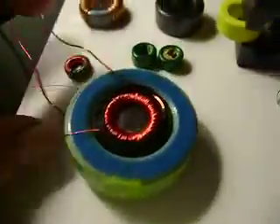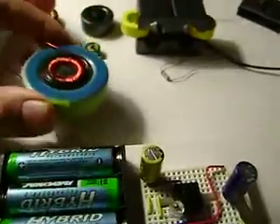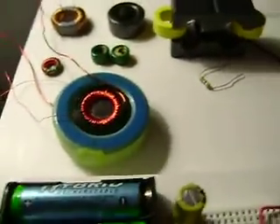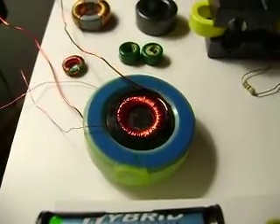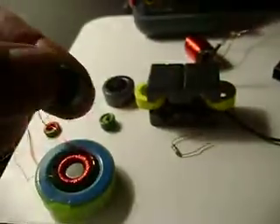I'm going to take the fan off for now — I just had it set up as a demonstration. I have some different toroids here, different lengths. This was an ore/ferrite bagel core and it's not working really well. One thing I've found is that just wrapping the core and then putting the pickup on the outside doesn't work — it works much better the way this one's done, with the pickup wrapped underneath the toroid.